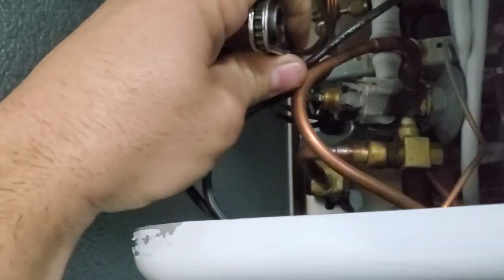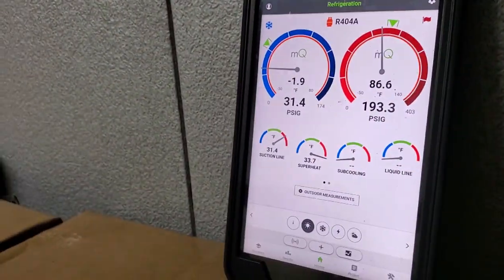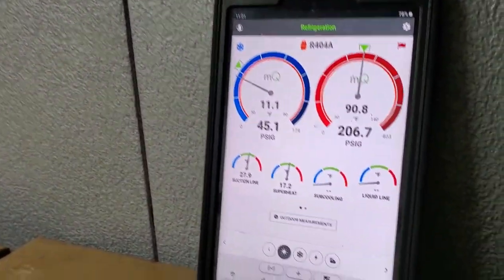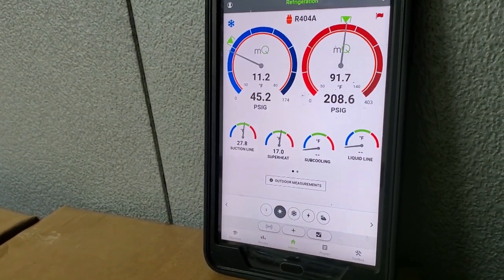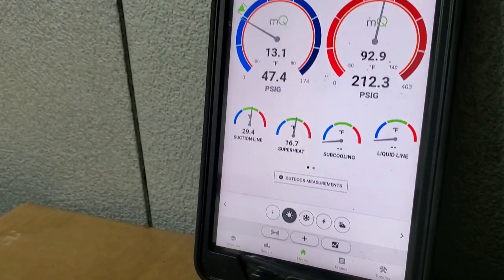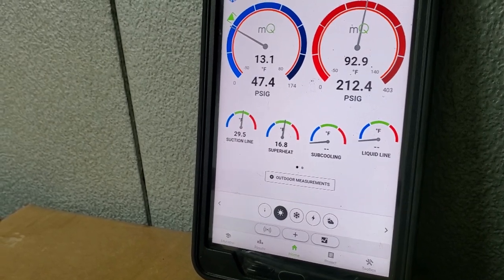We're running with a slight mist keeping us below 179.2 PSI. Going downstairs: hot discharge line, cold liquid drain, warm coming out of the head pressure control valve. So we're feeding warm or hot vapor into the top of the receiver, and the problem is we don't have a proper liquid seal — our sight glass is flashing. We're also running rather high superheat — this is evaporator superheat. The coil is frosting up coming out of the valve, but the coil itself is not frosted up. We're going to bring the superheat down by adjusting the stem out of the valve.